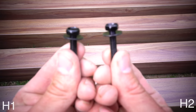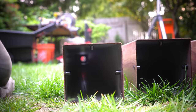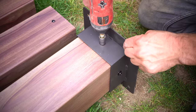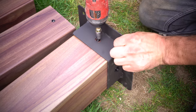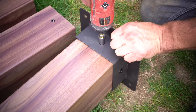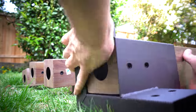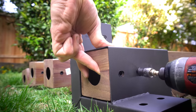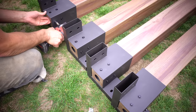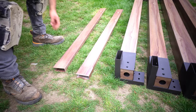One of the best things about this pergola is the fact that it's so easy to install. Literally only two different screws come with this entire kit — one being one inch and the other one being an inch and a half long. The first step is to install our base plates to our posts. There are four posts and each post gets a base plate attached with four screws, one on each side. Once all four base plates are installed we can move on to our post tails, which install at the very top of each post via four screws on two different sides. Every single fastener you've seen so far is the shorter screw, and I don't touch the longer screws until the very end when installing the top beams overhead.